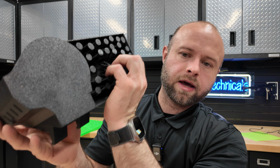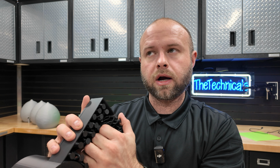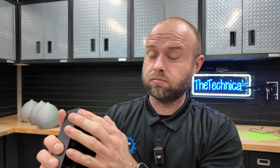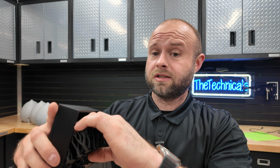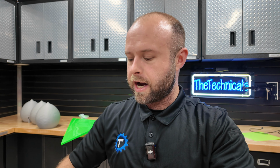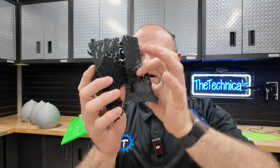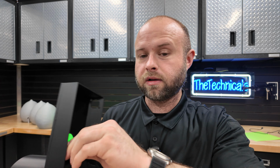This is Sunlu's standard PLA, and I jacked the top Z distance up on a 0.2 layer height. I jacked it up to like a 0.25, so kind of a big distance, but it's underneath here. It's not like I need a good surface finish, and this is a mythical, beautiful pull. One pull. That's why I love doing this live, because you get my genuine reaction. Oh, it's like Christmas morning. Look at that. Beautiful, smooth. Came out pretty good. Sunlu PLA working out pretty good.